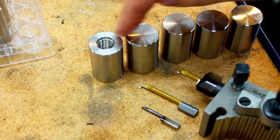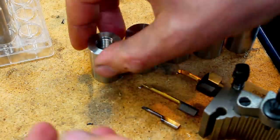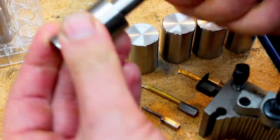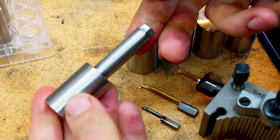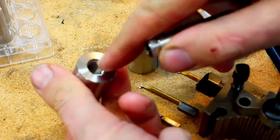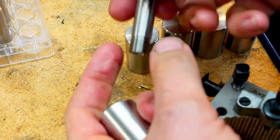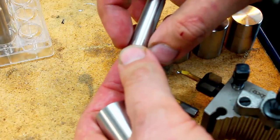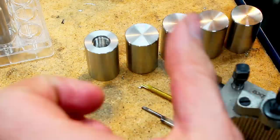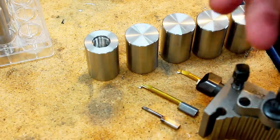So I prepared 5 of these blanks. The first one already has an M12x1 fine thread on the back side, and this screws together with these parts very nicely, and it's threaded in a way so this part bottoms out on the floor here. And there is a recess bore here on the top that grabs the mating part here on the OD. So this increases strength against bending. At least that's my interpretation of the original design.